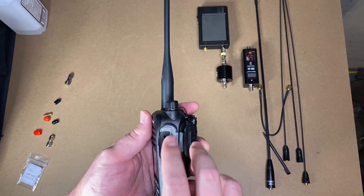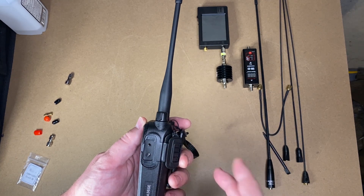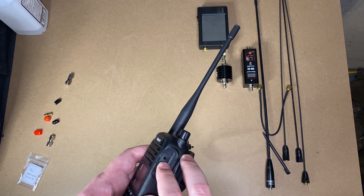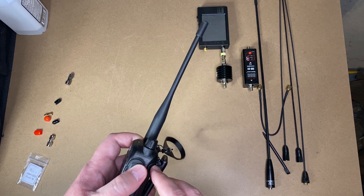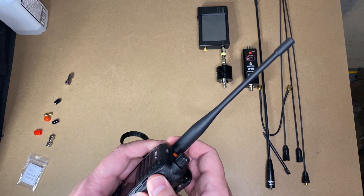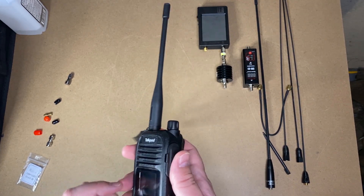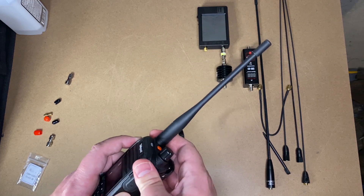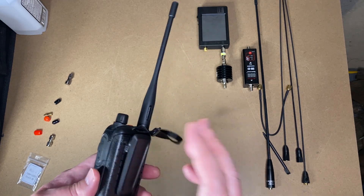The second thing I don't like: this uses a Kenwood-style plug for speaker mic and data cable — it does work with CHIRP by the way. But the weird thing is if you plug a speaker mic in and I tried it with several different ones, the power level driving that speaker drops a lot. You can hear it if you're in a quiet room, but if you're in a crowd of people, forget it — it gets so quiet. You can have the volume all the way up and it won't make a difference. It is the only radio I've ever had do that — something in that circuit just isn't quite right.